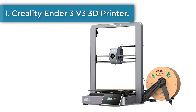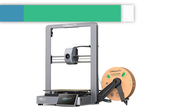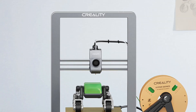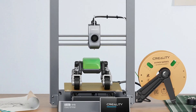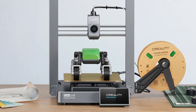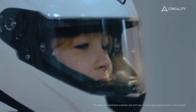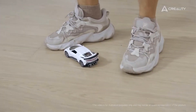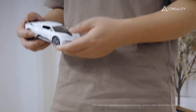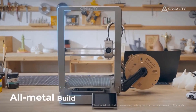Number 1: Creality Ender 3v3 3D printer. The nozzle and heat brick are unified as one to block heat creep and ensure easy swap. The nozzle is tipped with hardened steel to confidently handle carbon high-strength engineering filaments. The direct extruder kit is enhanced by a bolster spring and a ball plunger for more than 1,000 hours of clog-free extrusion. A 60-watt ceramic heater encircles the hotend, able to fully melt ABS, PETG, PLA-CF, and other high-temp filaments on the fly.